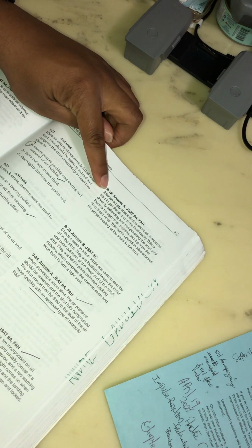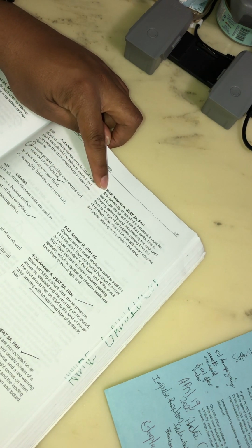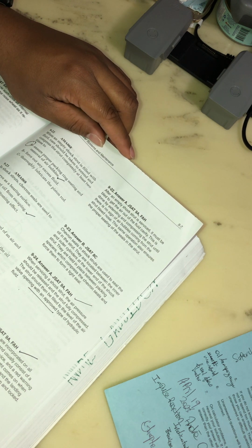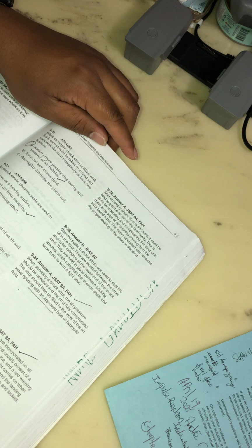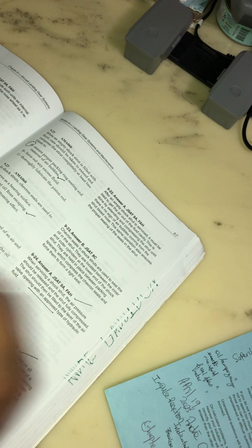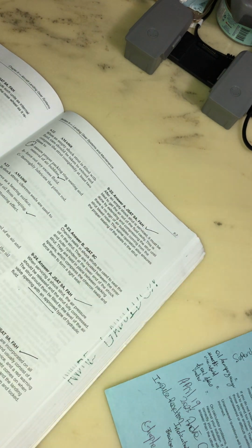After an empty shock strut is serviced, it must be bled to get the air out of the fluid cavity. This is done by extending and compressing the strut until there is no sign of air bubbles coming from the strut bleed hose. This same operation also ensures the proper seating of the seals in the strut.